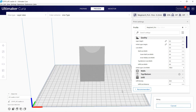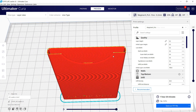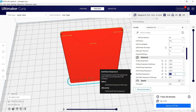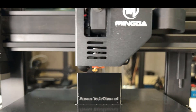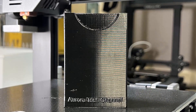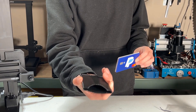Finally, I will print some flexible filament. I've designed a card wallet and it would be perfect for this test. I won't slow it down — I'll print at normal speed. The only change I made is to increase the printing temperature to 220 degrees and the print bed to 80 degrees. There is a tiny bit of stringing at the top, but the print is still quite nice. I can fit 4-5 cards in this card wallet. This flexible TPU filament is really nice, and I've put the link below.